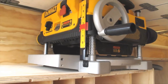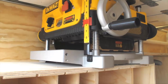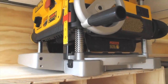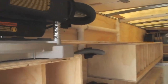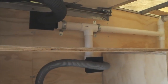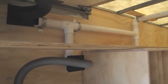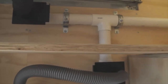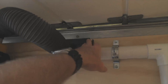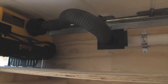It can be taken down and set on the workbench for production planing. Infeed of course is unlimited because it goes outside the truck, and then the outfeed is far longer than I'll need. I've also added a vacuum system with two inch plumbing pipe and integrated the standard two and a half inch blast gate, so I've got a vacuum system with the blast gate here to collect dust when I'm planing.